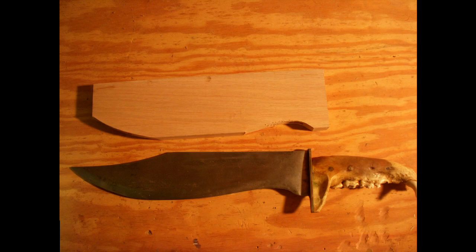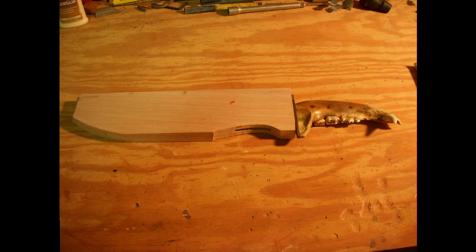The next step: in order to make the knife sit into the sheath very solid, I used a piece of red oak and shaped it to a very close degree to the knife shape. I also cut it down the middle, leaving maybe about a quarter of an inch so that the blade can be inserted easily. Then I put in a little strip of wood to make it truly a pocket for the knife to slide into easily.